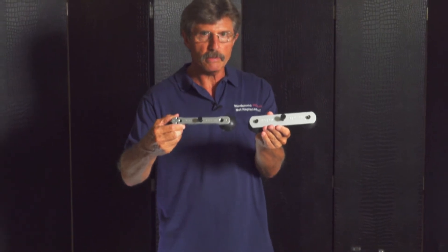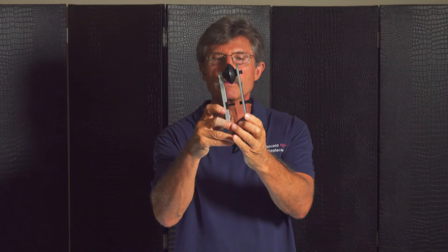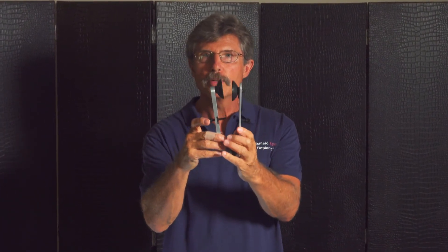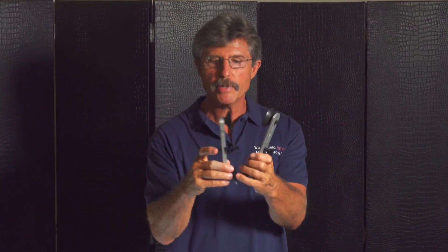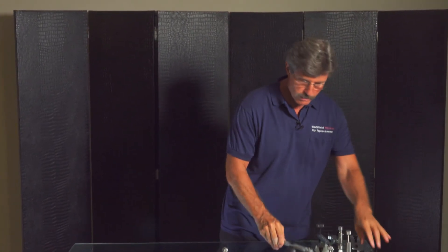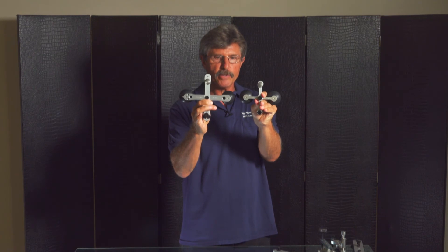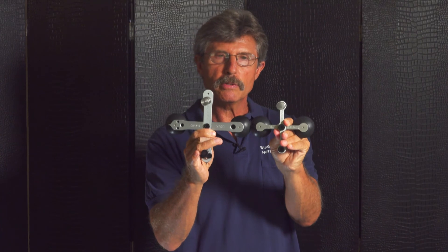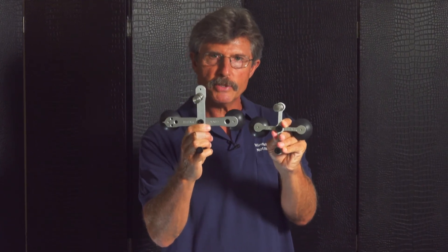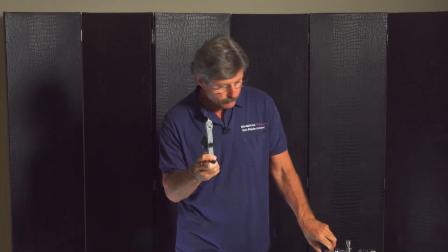The spacing and suction cups are the same between old and new. The bolt on the new version is a little narrower, which we found opens up the crack wider with less pressure, reducing the chance of the crack going through the bullseye at the impact point. The new Crack Master Bridge is quite a bit bigger than the old bridge, which gave better compression on stone breaks and made it much easier to straddle down a crack. Finally, the new Star Leg Flexor replaces the old star flexor tool — five tools in total replaced by the Wonder Bar.